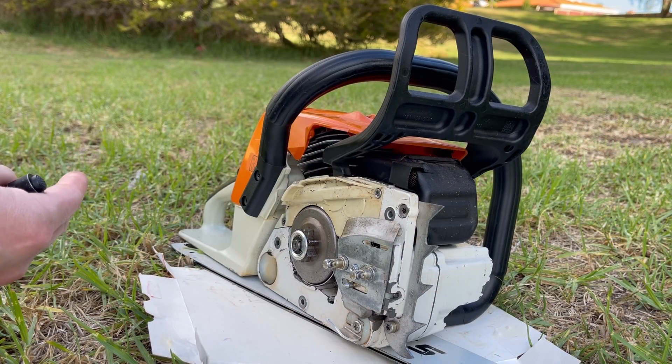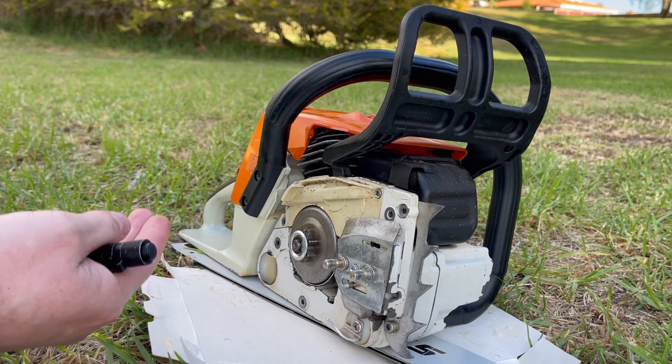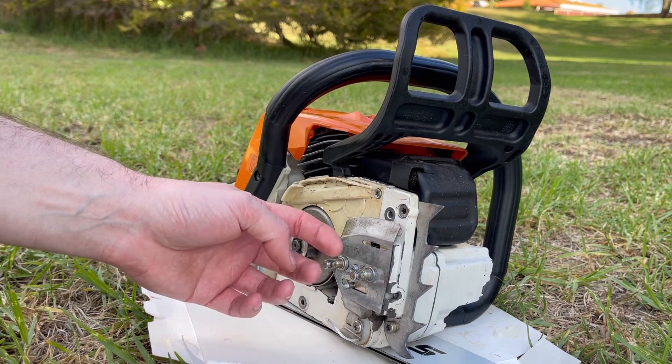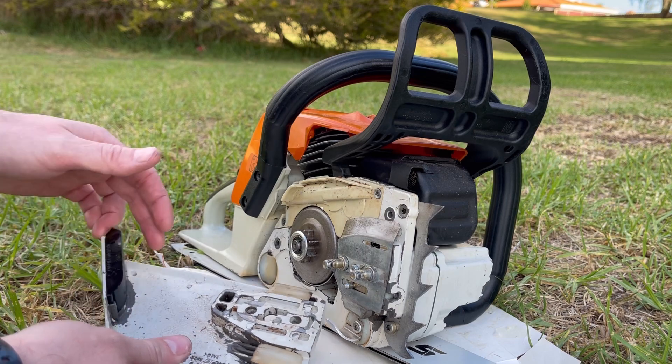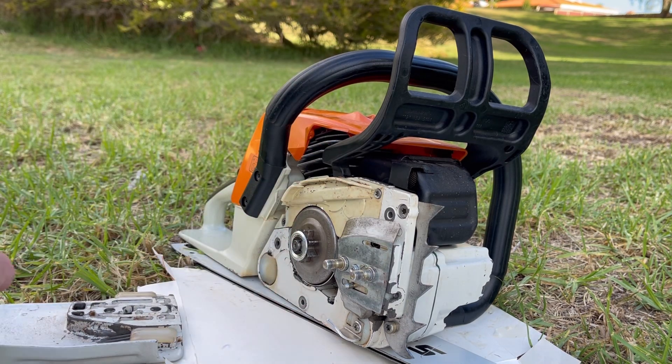The last two are the most common causes of oil leaking from your saw. The first is residual oil — there's a huge amount of oil being pumped out as you're using the saw and it covers all these surfaces. If you leave it over time, gravity will act on that oil and it will run down and sit in a pool. Give it a blow off after use, remove the excess oil if you can, and you may find that's all it is — just a little residual oil with nothing to worry about.